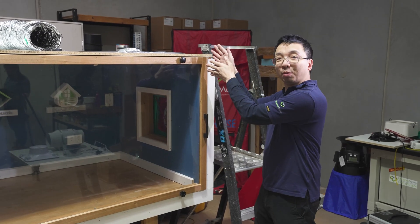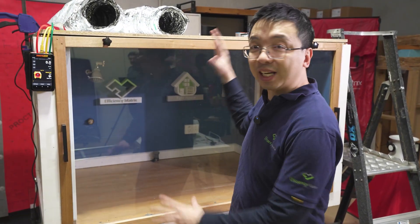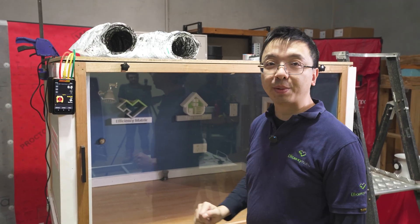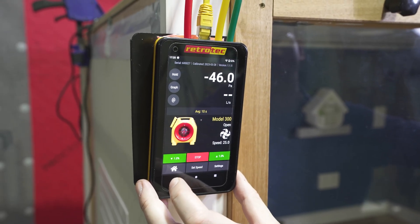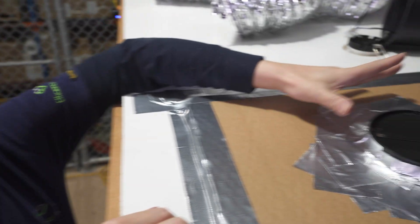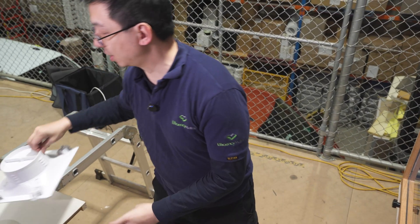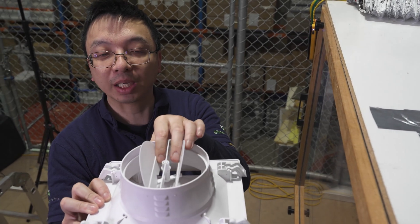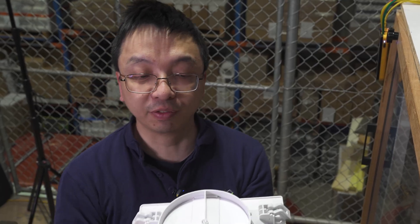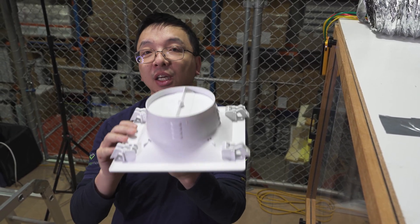Now let's see how this new modular system works. I'm going to turn on the fan to blow air into this enclosure and see how this Draftstopper reacts to different pressures. We are now exposing the Draftstopper to a pressure of 50 pascal — as you can see, it's not opening at all. When you compare this to a conventional gravity-loaded Draftstopper exposed to 50 Pa, it would already be opening. On a windy day, if your system is exposed to wind above your roof, the suction from the wind alone will open up that kind of gravity-fed Draftstopper.